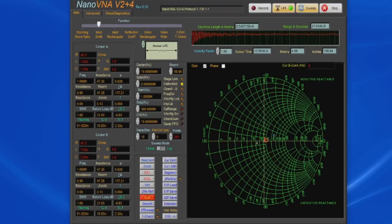And let's change our stop frequency to 3 gigahertz. So again, this could be 3000 meg, for example, or we can just put in 3G. You'll notice that there's also a center frequency as well as a span. We can change the center frequency, for example, to 20 megahertz. We'll just put in a 20M, and automatically this is going to use a 4 megahertz span.